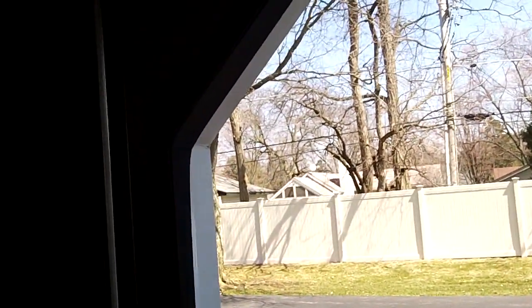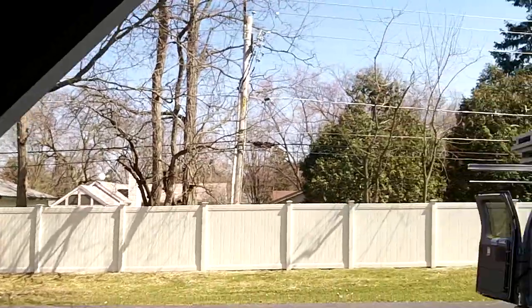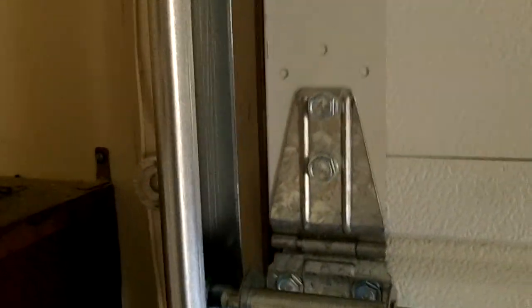It's also a large tongue and groove because this door is pinch proof, which is nice. It's also got a larger R value of about 9. I'll stick my finger in here in the middle and it just pushes them right out of the way — great safety feature, it's pinch resistant. It's got all nylon wheels and 14 gauge hardware.